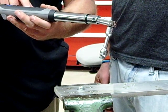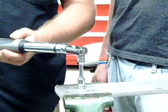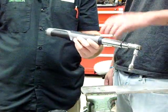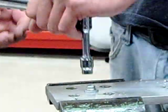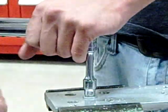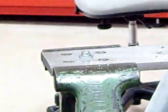It was at 16 pounds — what I was noticing as he was doing that is it wasn't clicking. Whether it was stuck on the last setting — we just want to notice it, so let's reset it now. Sometimes if you leave it set too long on the bench, it's going to get you. You want to make your actual last adjustment. Let's knock it down to five — that's the minimum. Let's go ahead and do eight and see if we're good. What a great lesson in the tool — how the digital one can get you into trouble. So he's holding eight foot-pounds on here. Has it ever hurt you to double-check yourself? No. Stop, question things.